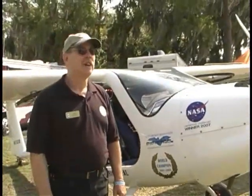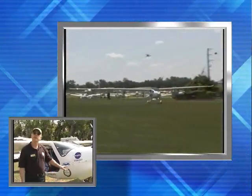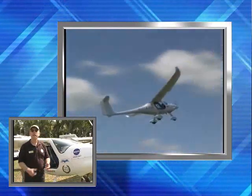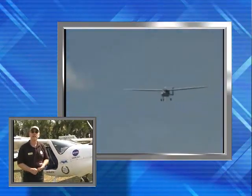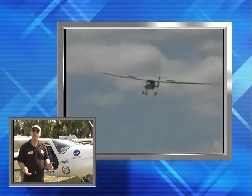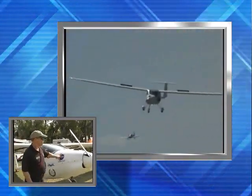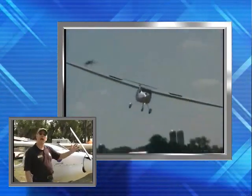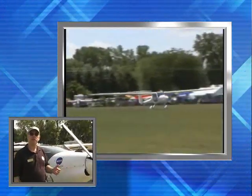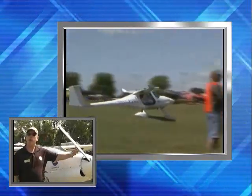As opposed to the Virus short wing model that uses 100 horsepower, this uses the Rotax 80 horsepower — personally one of my favorites of the 912 series. It can use regular automobile gas, not high test, and it's a little less demanding of the engine, so there tend to be fewer problems since it's not being pushed quite as hard. This prop on the front can go to a feathered position for less drag. Because it's a motor glider, you don't want a big fat blade sticking into the air if you can help it.